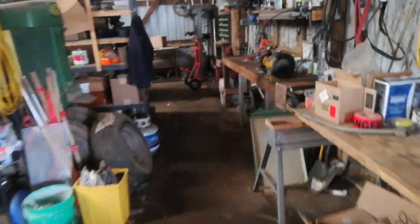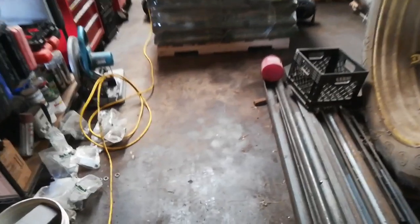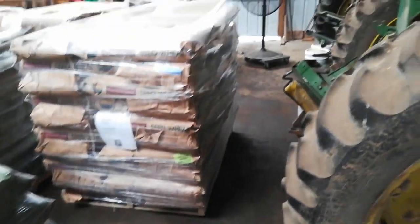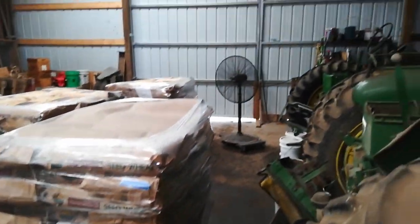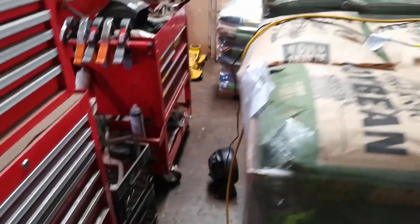I'll show you inside. I've got a moisture problem in this shed. I need to put drain tile all along the outside wall to intercept some of this water, because I've got standing water in this corner and I think it gets under the slab. You can see the discoloration — if it'll show up on the video. There's quite a bit of moisture that seeps in here and I'm trying to keep the humidity down, so I've got fans going on these seeds.